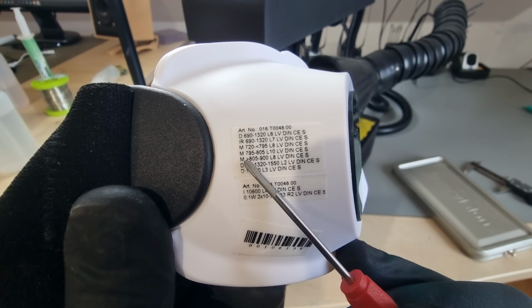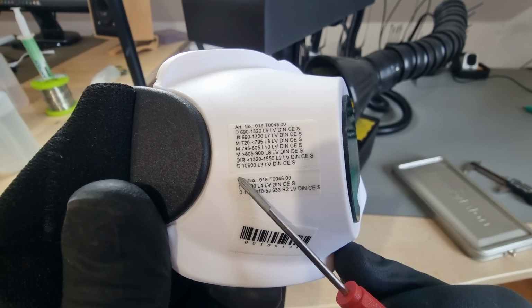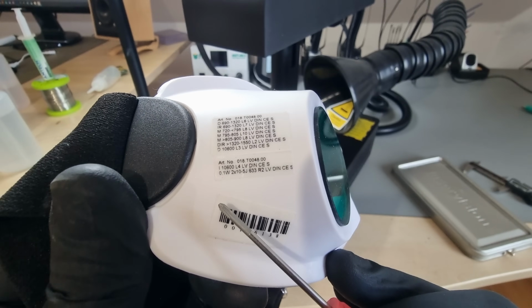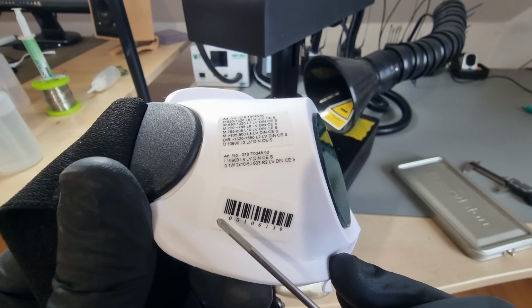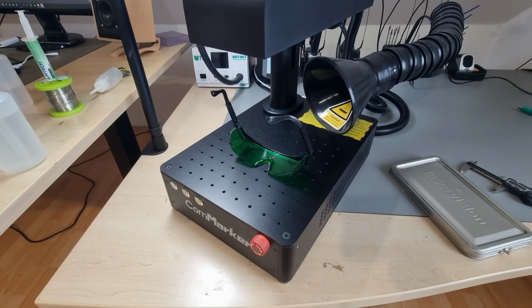The central column is the usable bandwidth, and the L numbers are the attenuation for every row. The higher the better. For a 20-watt 1064 nanometer fiber laser engraver, I'm feeling reasonably well protected in the 7 neighborhood.